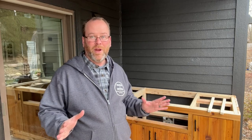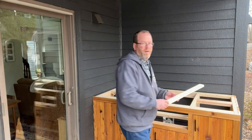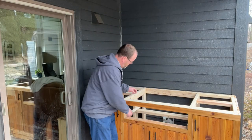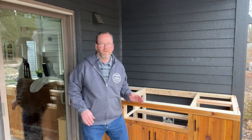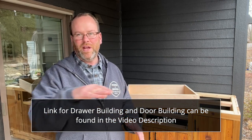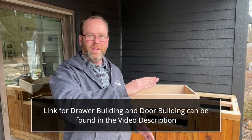As we get started on the drawer, I just want to go over the basics. This is going to be really simple — kind of old school, like a dresser drawer you might have had as a kid that just slides out and pushes back in. No real hardware. We're just going to mount these wooden rails in there, and after the rails are mounted, we'll just put our homemade drawer sliding right in. Maybe put a little bracing on top so when you pull the drawer out it doesn't get all tipsy-turvy. I didn't build extremely tight tolerances — I just want this to work, so that anybody at home can do it too.